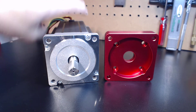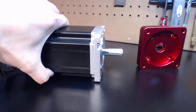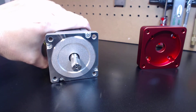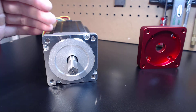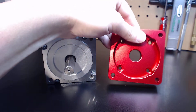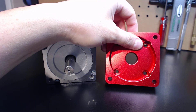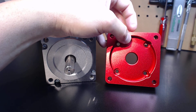Honestly, a NEMA 34 — the one I have here is one of my 1700 ounce, 5 amp motors. This is a massive motor. These NEMA 34s weigh in excess of 10 pounds each. So the mounts I've typically seen on the market are just really flimsy. They do use 6061, but the adapter plates were just crap. That being said, I decided to come up with my own design. You can see that we have internal pocketing here for the NEMA 23, so your screws will naturally sit in there. We've got a nice deep centering circle with a couple thousandths tolerance so we can get alignment correct.